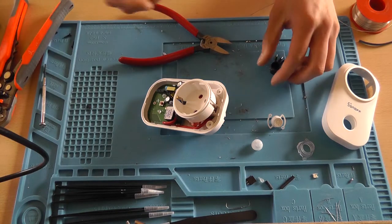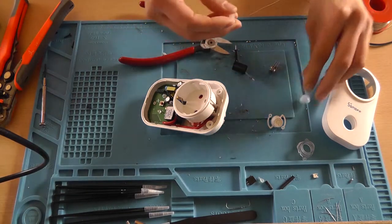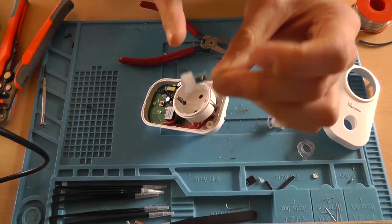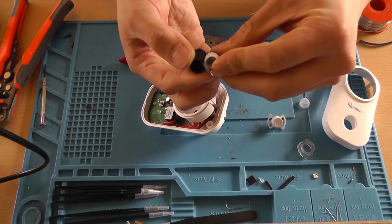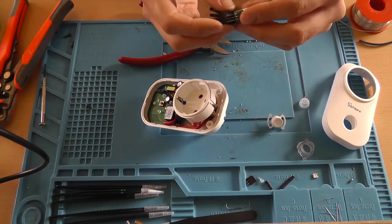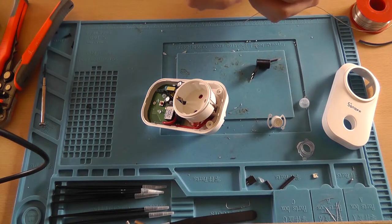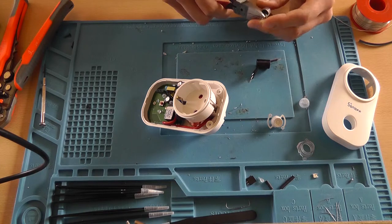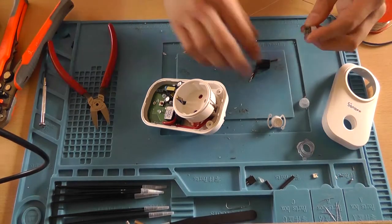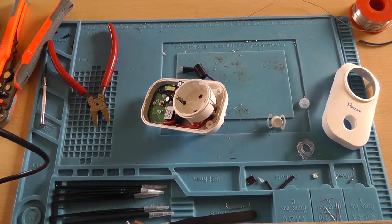There you go. Now what you want to do is pick the sensor up and remove the second cap if it doesn't come loose. Place it. Now you want this edge of the cap to precisely align with the edge of the 3D printed part. So we need to cut the headers, I think, to halfway. So it's about here. Cut the headers because they're too long, of course. Now you don't want to touch the PIR. And I accidentally did.